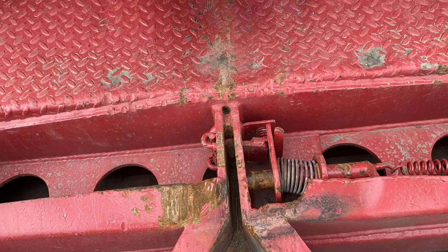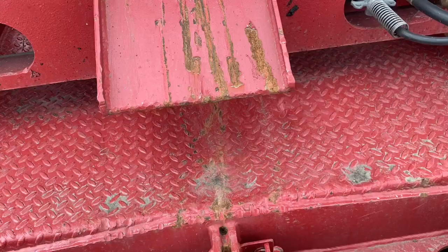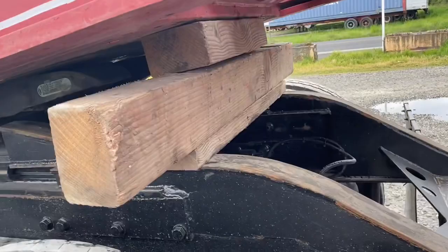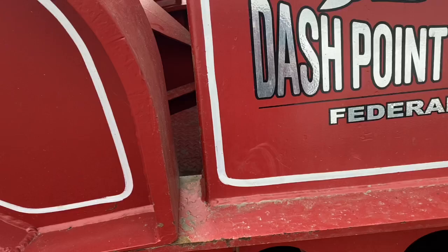So you want to make sure it's just barely behind the one we're going to try and reconnect to on the trailer deck. If this part was sticking out over the top of this, we'd never get reconnected. You don't want it too far back up on the trailer either, because then it makes it hard — your truck tires hit this part of the deck and you can't get up there to detach it. You want that as close to it as possible, almost straight up and down above it.